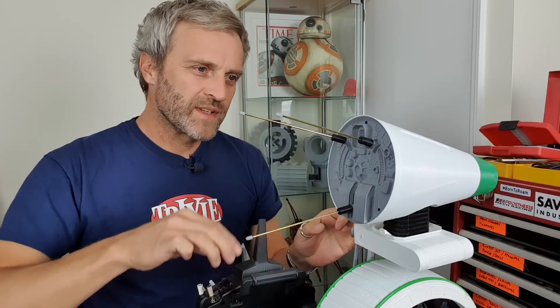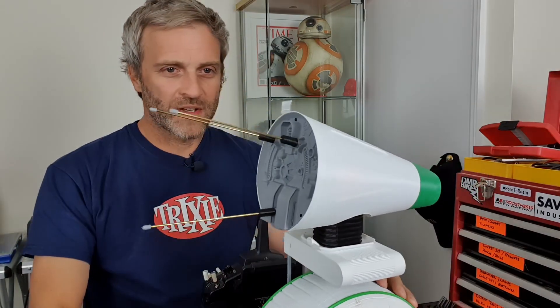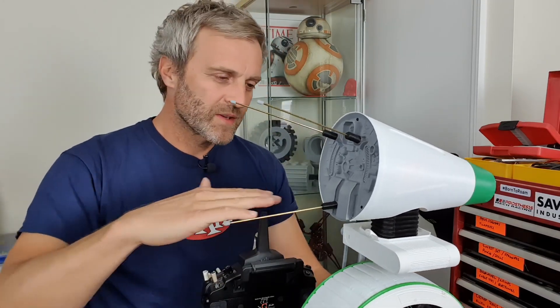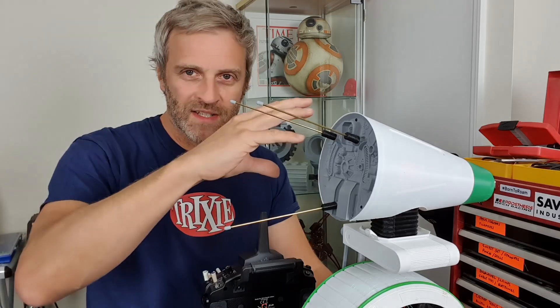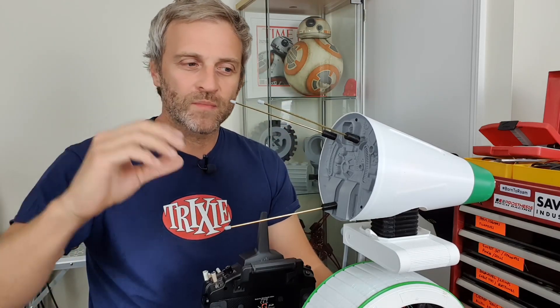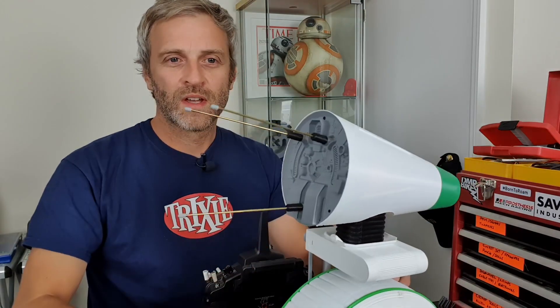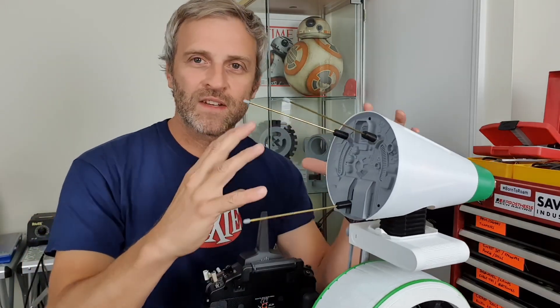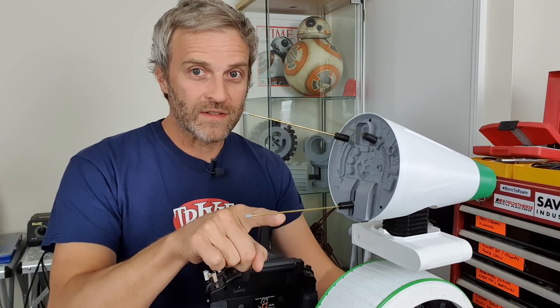The other thing I wanted to do was give these antennas some life of their own, going back to my technique of free animation. I've picked up the IMU sensor that's tracking Dio's motion and feeding that into the antennas, so when he accelerates they kind of pull in and then splay out when he stops. It's quite slight at the moment but you can see them doing something as I manually move him back and forwards. The antennas kind of stay alive without actually having to puppeteer anything - though there's still that oscillation I need to sort out.